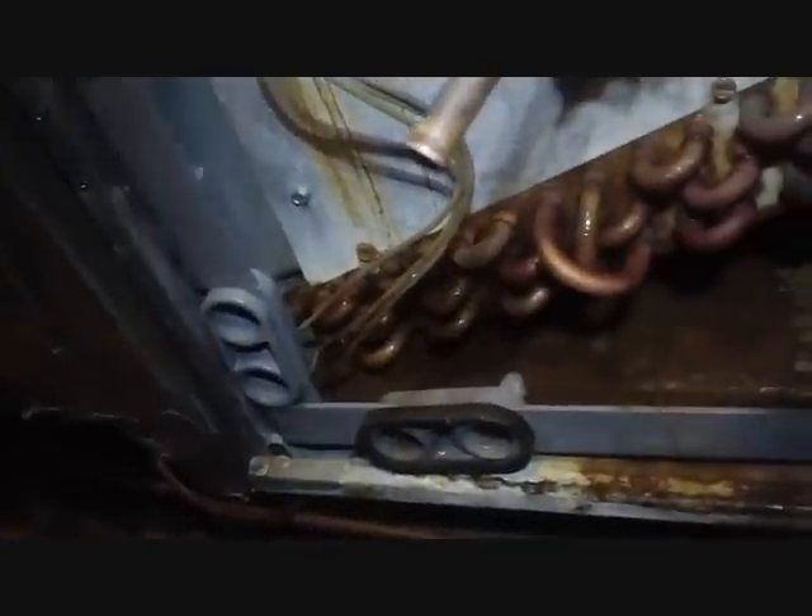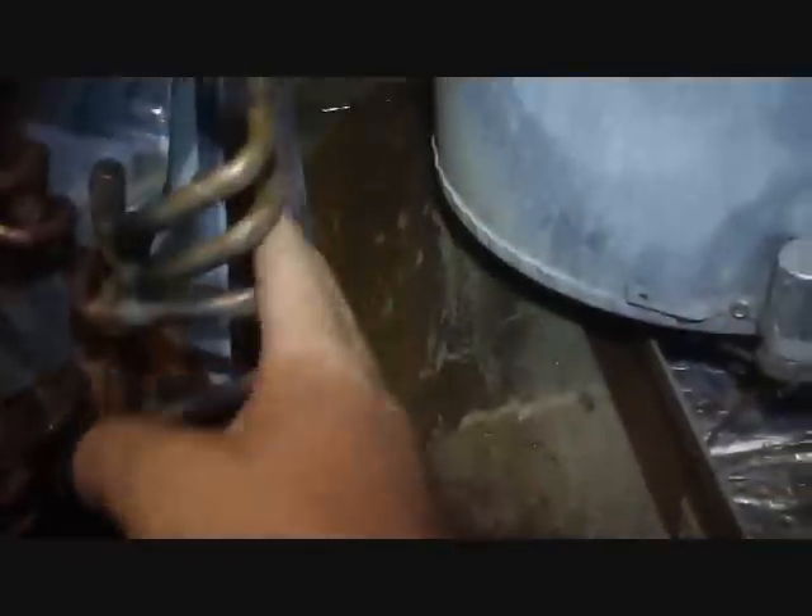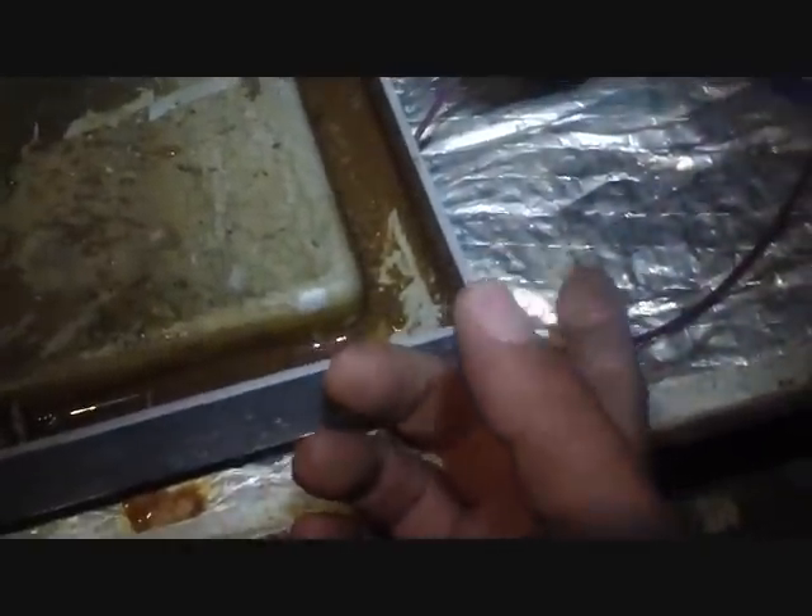This is our old evaporator in the air handler — they reused the pan. These pans are real bad as far as water pooling in the tray, with the blower being able to pick it up because the pan isn't sloped enough for the water to run off quickly. Sometimes water builds up before it can drain because of the way the drain holes are in these Goodman units. What I like to do is take two rubber or cork vibration pads and put them underneath the ends, especially on left-hand discharge air handlers, to get water off that area so you don't have to worry about the blower picking it up and slinging it.